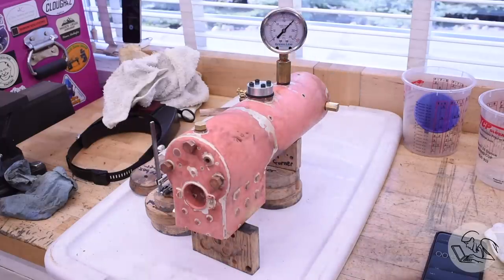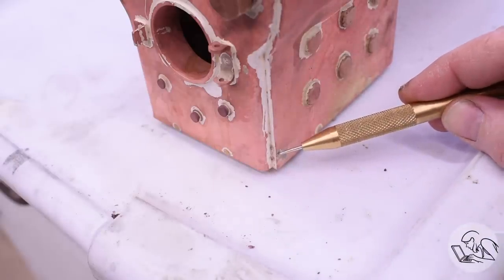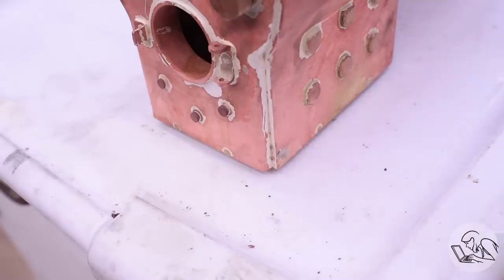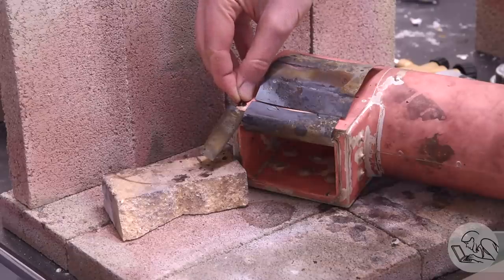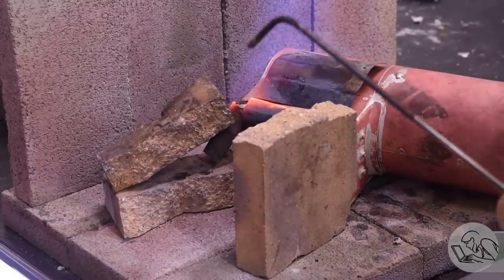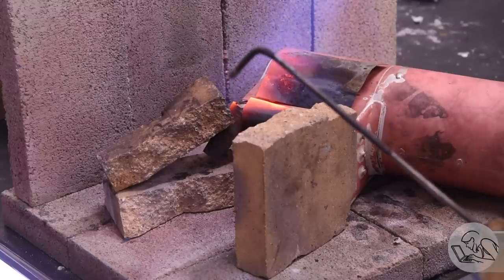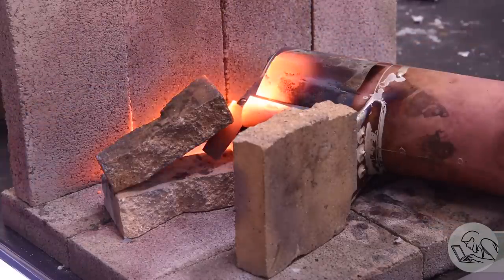Back up to 200 PSI after the steam dome repair, but something is still seeping - a little drip somewhere below the firebox. I started getting suspicious of that fixturing screw again. You can see the solder next to the screw - very decorative, really ties the room together, but didn't actually fix the leak because I missed. I hemmed and hawed, tried mechanically staking it which helped a little, then ran out of excuses for not doing the right thing and put it back under the torch. This time I've got sheet metal protecting the foundation ring everywhere the torch might reach, plus a better angle that isn't going to impact the foundation ring directly.